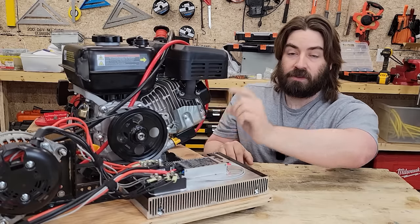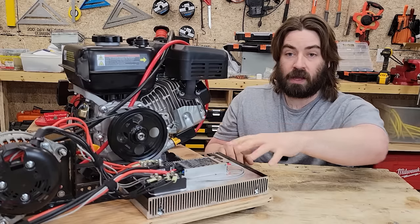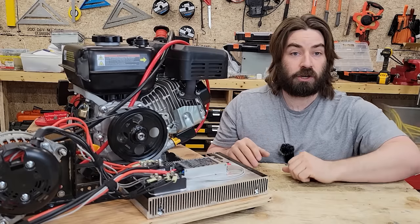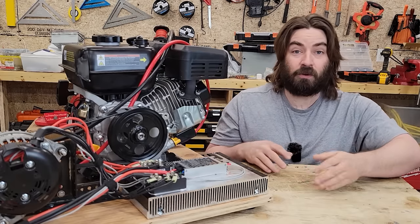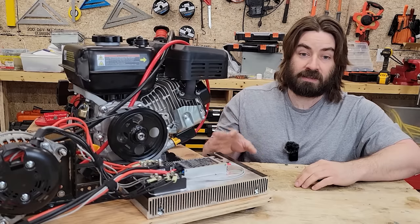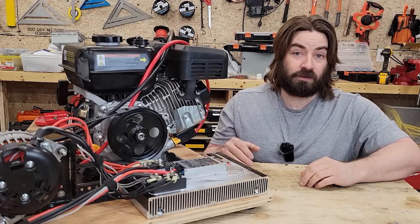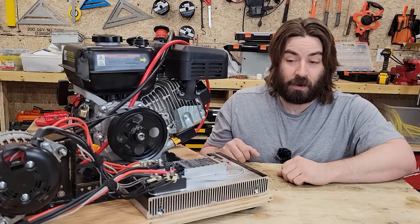Now, the alternator I bought off Craigslist for $100, and this was $170, but we have a lot of other things into it. So I'd say we probably have $400 or so into the full build, not including the charge controller. So now that we actually ran it and we got some numbers, I know that we certainly don't need the expensive Victron charge controller. I could probably do this with a lot less expensive charge controller setup, given that we only have the 90 volt open circuit. So you only need a 100 or 150 volt charge controller. But overall, the whole setup worked really well.